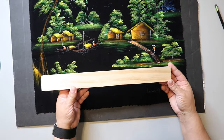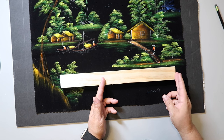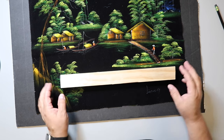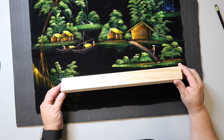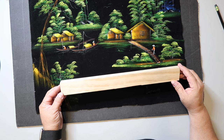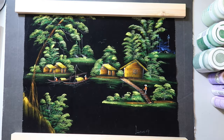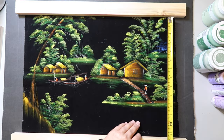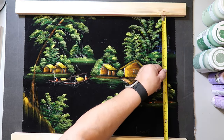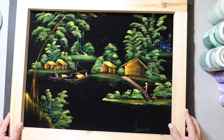Here's the measuring tip: measure from one side in, then the other side in, so you don't have to account for the width of the saw blade — that's math I don't want to do. My husband told me to measure from the outside in on each end; it's just an easier way to get your cut measurements. Then I'm checking how everything fits, making sure the inside piece lines up and everything is square.